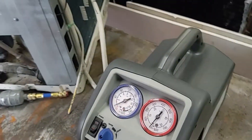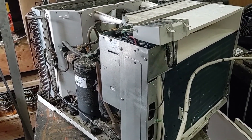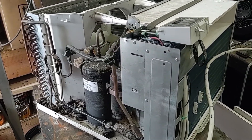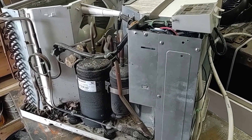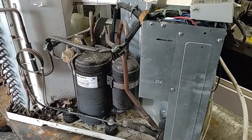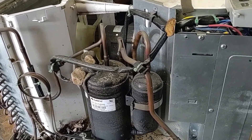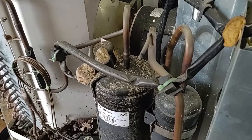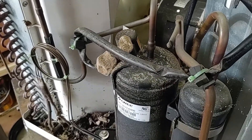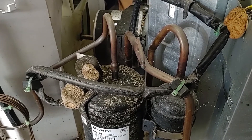The next test I have for this is actually working on a window air conditioner. I'm going to be pulling all the R410 refrigerant out of this. This is going to be converted into a split air conditioner instead of a window unit. If you're interested in the full video on that project, subscribe to the channel. This does have some access points, but they don't have any valves yet. I have some self-piercing valves to tap into the system, so let me install those and get to the next test.